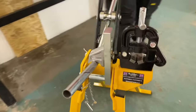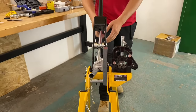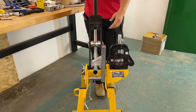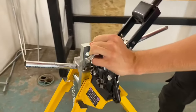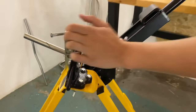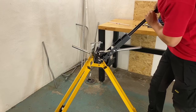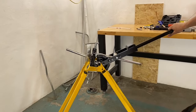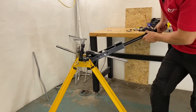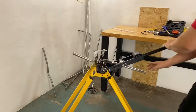It's also very important to make sure that this line is running straight — we don't want to finish this double bend and realize it's twisted. So you're going to just line that up. You happy with that one? I'm happy with that, yep. Mark's in the right position, let's just check it again — bang against the former. Now you've got to pull these two parallel with each other. So again, a little bit of care, take your time. We're looking for parallel with each other. I think that needs just a touch more. Is it best to be under than over? It is, yep. So that looks pretty good, we'll take that out and have a look.